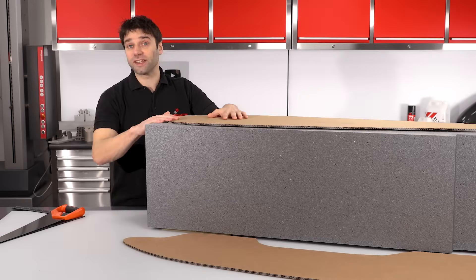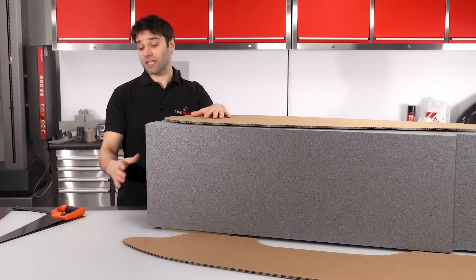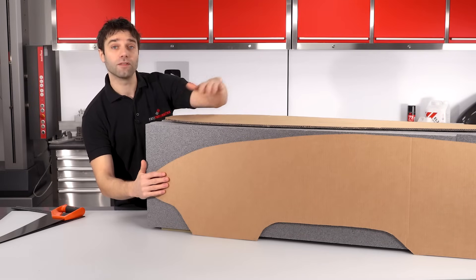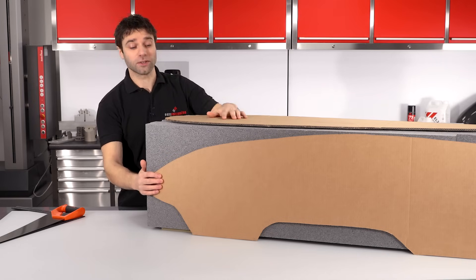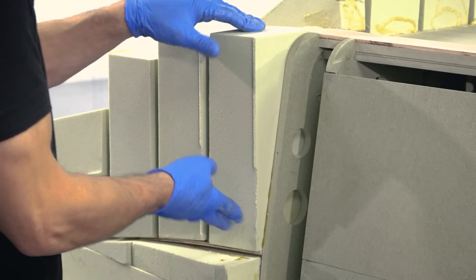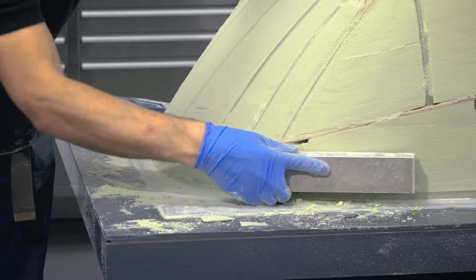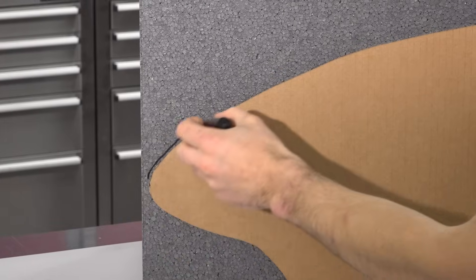The foam's now bonded together so I can get on and start creating the shape itself. In the interest of keeping this project as simple as possible, I've just got some basic cardboard templates of the side view and the top view of the model I want to create, which I'm going to mark up and then hand saw out. Of course, if you did have the facilities, you could CNC machine this directly. Alternatively, you might choose a hybrid approach of creating section views, filling this with foam and shaping it in. So let's get this marked up.